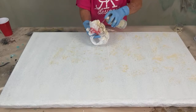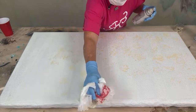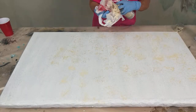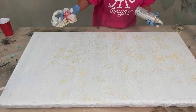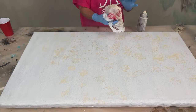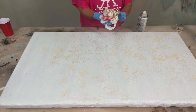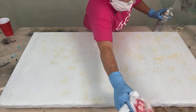Okay, I'm going to show you what you don't want to do. Can you see this color very good? Not really. That was like the worst color to start with. Well, I always start with my lighter colors first. And why is that? Because it's so much easier to darken a finish than it is to lighten the finish up. That's why. Any more questions?